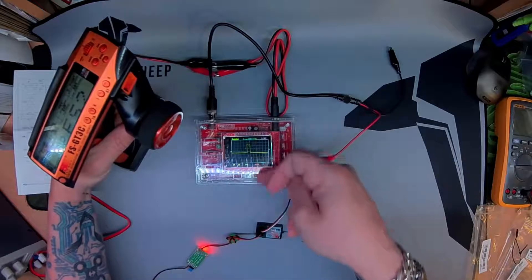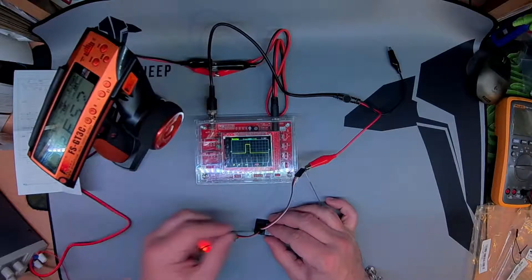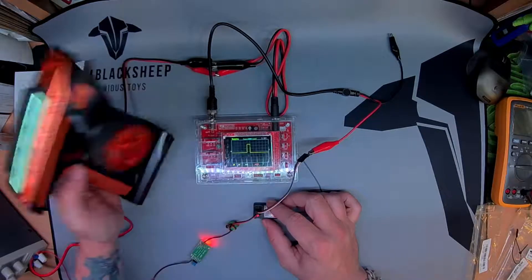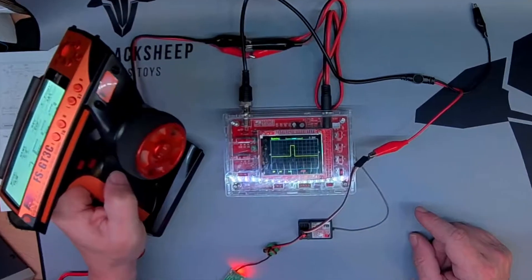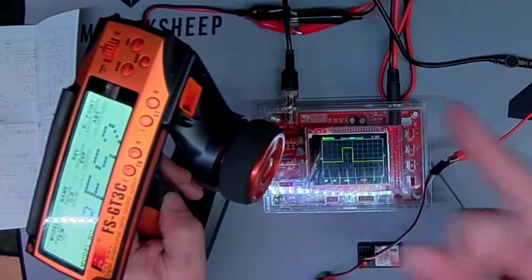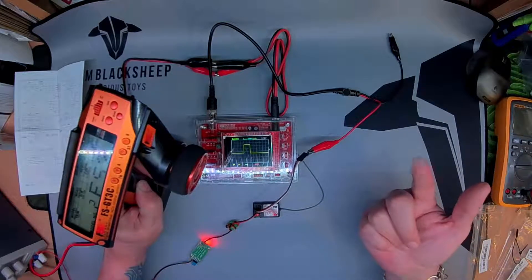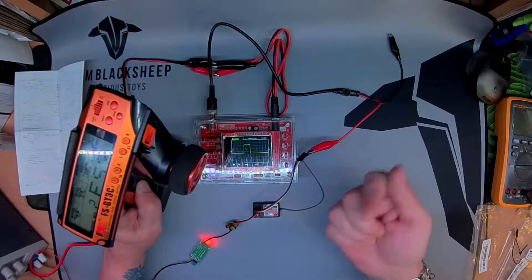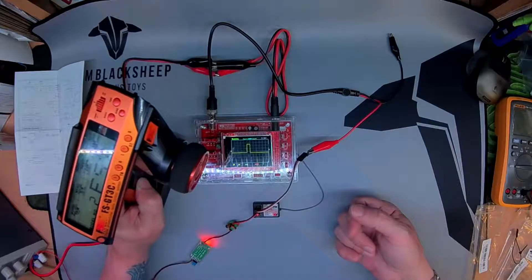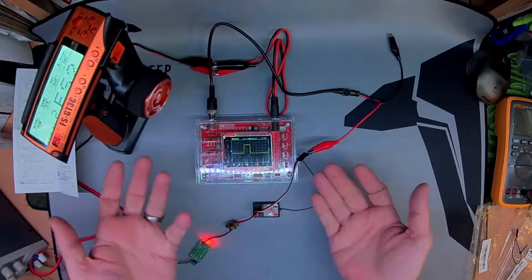Minimal deflection and it is increasing a very slight amount in voltage. What I really want to look at is channel three — if it's a momentary. Channel three is perfectly zero. It's a toggle — on or off. That's perfectly handy for my blue truck build where it has an orange beacon I'm putting on top, controlled by a momentary switch or toggle that cycles through five modes.